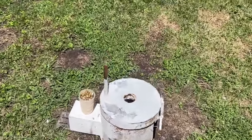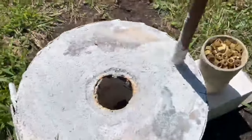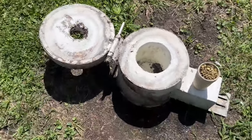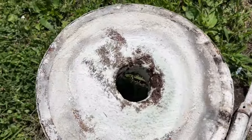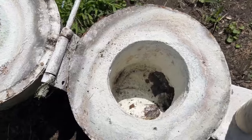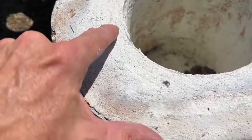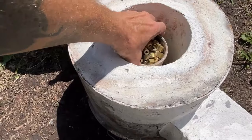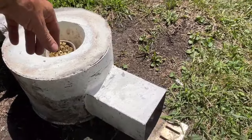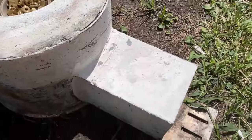So this thing's been out in the weather. We're doing a little testing on that other zirconium paint we made. Looks fantastic on the inside there. This is white as can be, except for where that iron oxide contamination's at. It's actually vitrified right there. That's glass. So, man, it's got a really neat crystalline look to it now. That's really cool. So this is the zirconium oxide coating with the high emissivity, an emissivity of like 0.9 versus the 0.6. So you're getting a heavier heat load going to the job. Yeah, but this paint, it stands up to rain.